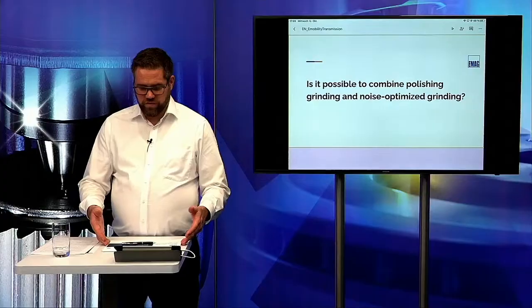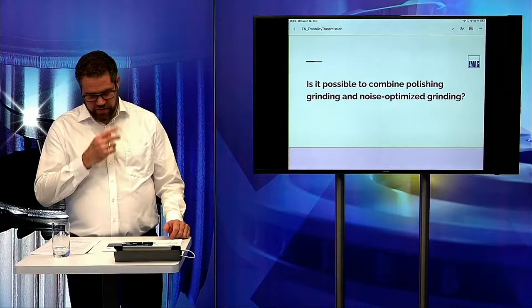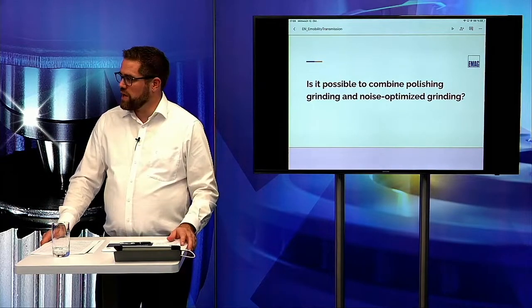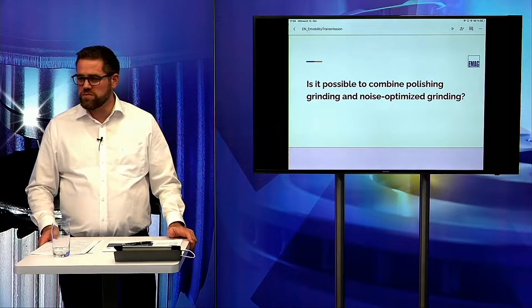Alex, there is also a process question. Is it possible to combine polishing grinding and this noise optimized grinding? No, I think it's not necessary, because the results coming out of the polishing grinding are so perfect that it's not necessary to put another software on this. We didn't do this when we are doing this polishing process.